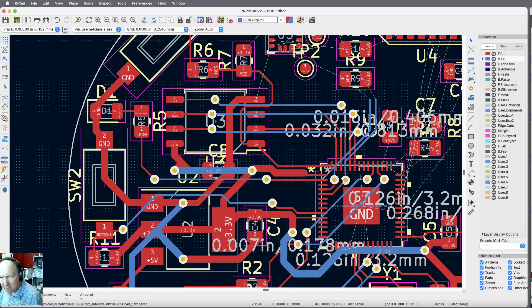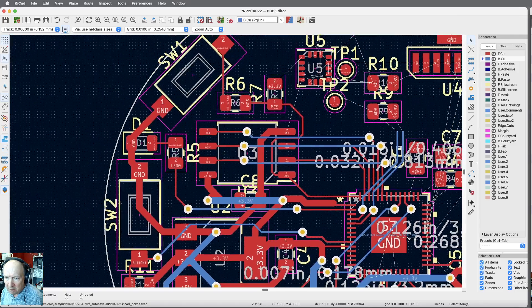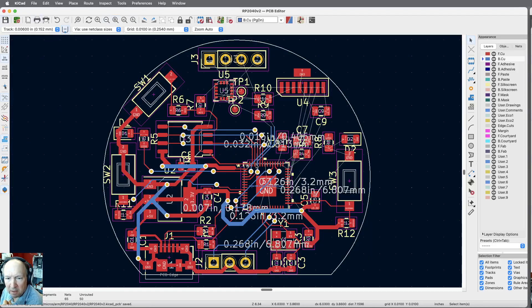Those are now out of the area. I've still got a few traces in here — some grounds and 3.3Vs. There's a 1.1V that needs to connect across — that's going to be a trickier one. I've about hit the time limit on this video, so I'll pause here and continue on next time. Save your work. We're down to 50 unrouted traces. I'm working my way around the micro — a few will be easy, a couple will be more of a challenge. Up here is the gyro or accelerometer, which will be interesting too. See you in the next video.